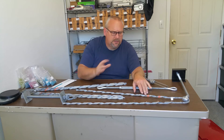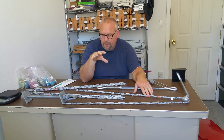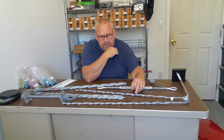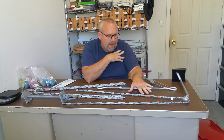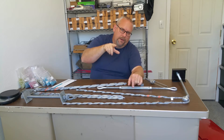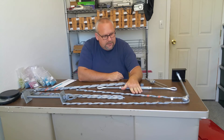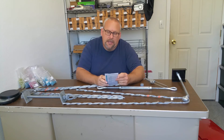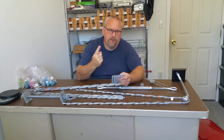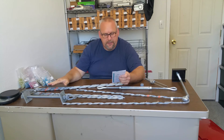These are called dead ends. There are different types — not only different lengths but other variations. They have an orange mark which I think is how you line up the wraps. Dead ends have something like sandblasting glass glued to the inside of the wrap. They form the wrap around a die at the factory and coat it with glue so the strands don't come apart. When you install it, you wrap it around the cable and it holds — it's like a Chinese finger trap. These are dead ends for 3/8 wire. The wire itself is 3/8 EHS, which stands for Extra High Strength — it's a low-twist wire, size one-by-seven with seven strands.